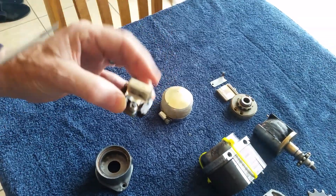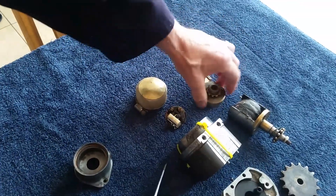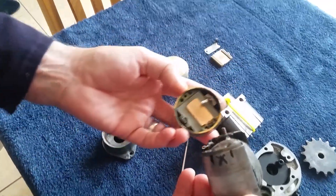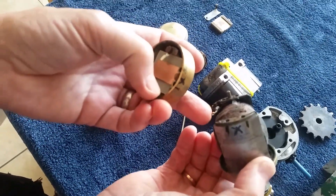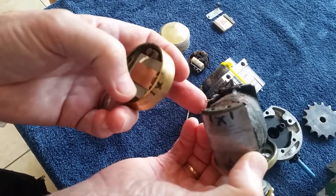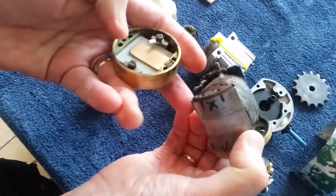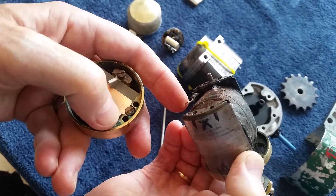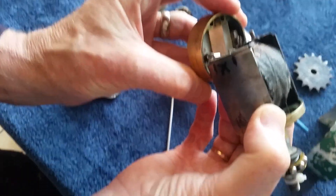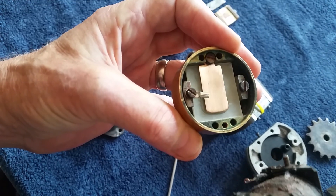That was soldered in place — that is now the condenser. Nice and easy; I don't need to remove everything again just because the condenser has gone. When you remove the original condenser, you'll end up with two little wires — a thin one and a thicker one. Solder those two together, because they were originally joined through the crimp areas. They need to stay together, and then solder both wires into the solder tag. You might have to extend the wire just fractionally to do that.